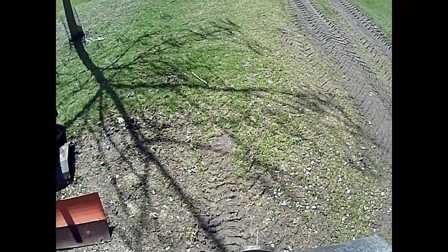I use that so much, you just can't imagine. Anybody that's ever used a back blade knows you just drag them along the ground and they're terrible. But you put a set of wheels on them, and now they won't just follow the ground. They'll take the high spots off and drop the extra material in the low spots. I mean, they'll actually level ground. And this all started out with me wanting to come up with a way to plow snow in the winter without tearing the yards up.